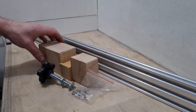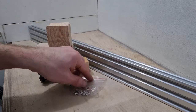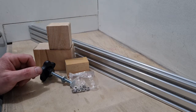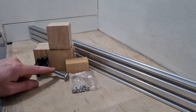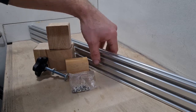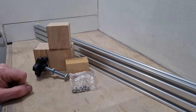You don't need much to build it at all. I've got some hardwood offcuts, a couple of bits of beech wood. I've got some drop-in rail nuts — this is 2060 extrusion which is commonly found on 3D printers and small CNC machines. The rail nut is going to go into the fence on the bandsaw, and this extrusion itself is fantastic because it's incredibly rigid, nice and light, and not too expensive.